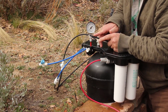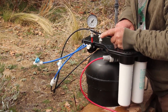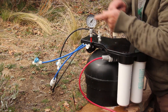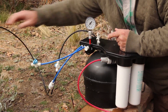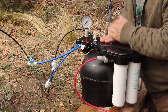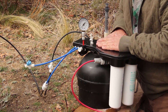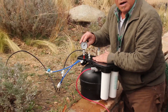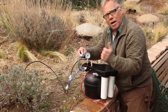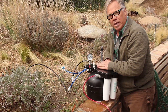If I put this line into a bucket under these operating conditions, I might accumulate about three gallons of waste to a full gallon and a half of product water stored inside the unit. I'm going to let this roll out onto the plant here. I'll walk away now, go inside, drill my hole through the kitchen counter, hook up the waste line and product water dedicated faucet, and hook up the feed. Once this fills up and shuts down, I should witness full line pressure on the PW gauge. I'll turn my valves off and turn my feed off, and get this ready for installation.